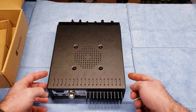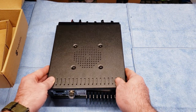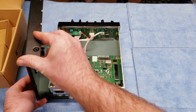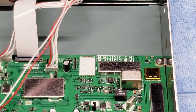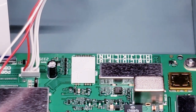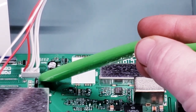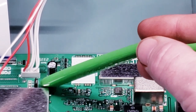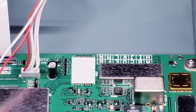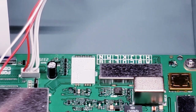Before I put this on the bench, I wanted to show you something. If you take the two screws out of the bottom plate on the side and one out of the back, you can very easily lift the cover up, being mindful of your speaker wires. Right here is the jumper that you'll move from where it comes from the factory over to the other setting, and that will open this thing up for 11 meters. Then you can do your programming.